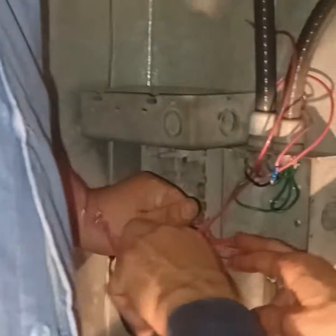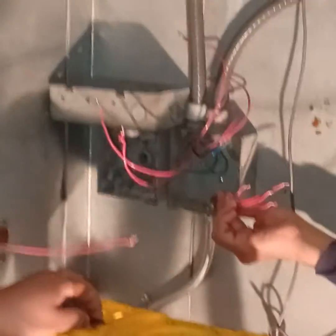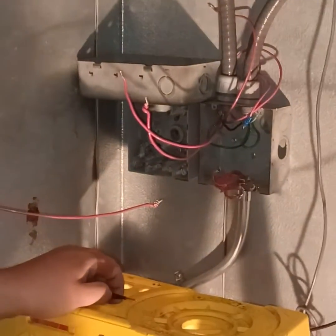Now we got to get all of this to the time clock. So, come down. These are travelers. See that? They're going in there. He just got to pick one here and find it over here running through the hole. Anyone you want. Well, since it don't matter. No, I'm saying you have to ohm it out. Well, how do you know which one is which? That's what the ohm is for. So pick one here and end up there.